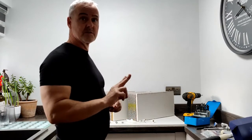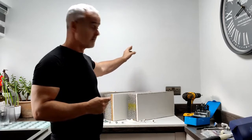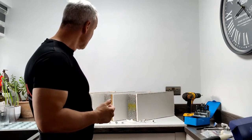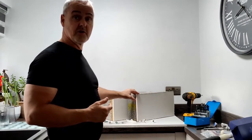Two questions that you need to ask: firstly, how big is the cavity behind that wall, and how is the wall being built if there is a cavity. I've got a selection here — breeze blocks, metal stud wall, timber stud wall, batten down block wall, and we've got a dot and dab wall.